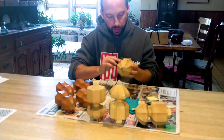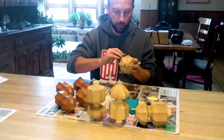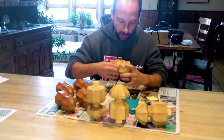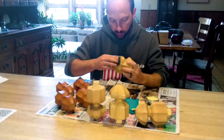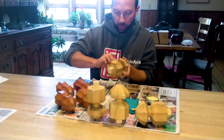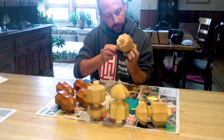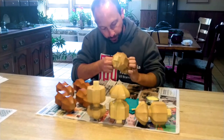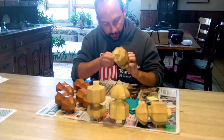It shouldn't take too much, because what we're really doing is putting a wax coating on the whole thing. And so we're going to work the wax into the grains of the wood, into the pores, work our way around. And with these gardenia-shaped legs, I can never remember which sides I've gotten and which sides I haven't. But it should be pretty apparent from the sheen what I still have left to do. Sometimes when I'm cleaning these legs up, I do see quite a lot of leftover wax, and this is probably why, because it's just kind of a pain in the rear end to get into every nook and cranny of the goban legs. Much simpler on a flat board when you're just doing a surface or a side to know what you've done and what's left.